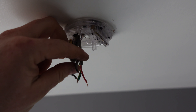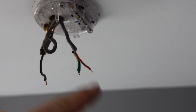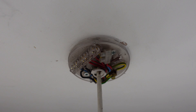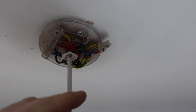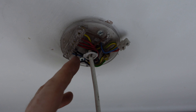In this first light fitting, we have got a single neutral, single live with an earth, and a neutral that the earth and live have been cut out of. I haven't taken the switch off yet, but what I'm thinking is the live is fed from the switch - that's our one switch live. Single neutral will be the end, and this one has just been added on over to there. If it is, we can leave it disconnected and disconnect the live in the switch, and that'll get rid of all those cables without putting a joint in. In the switch we've got permanent lives - it's a blue onto a red, and then a yellow is your switch live. So there must be a 3-core inside the switch, with a permanent live coming down, and they've used yellow as the switch wire, and then there are two neutrals. So we'll take the switch off and see what's there.